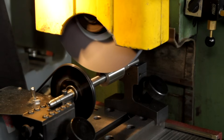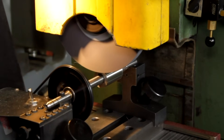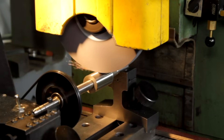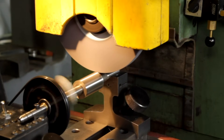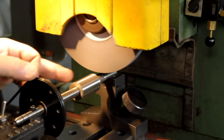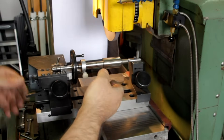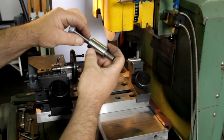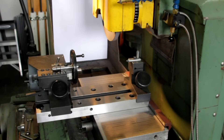Spark out. I'm just going to come back across on the same depth setting. This wheel might be a little bit too hard for this application. It's got a funny swirl in it that I don't like - it'll come out, I'll have a look at it. That's the problem with blue Molly - it gets on everything, it never fails.